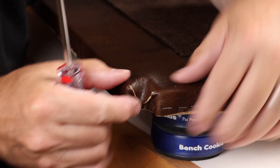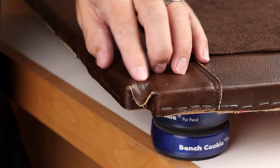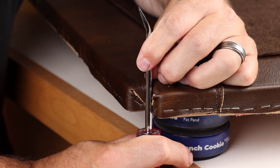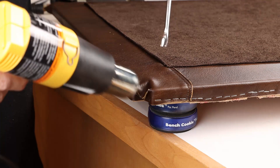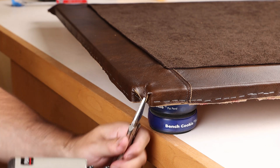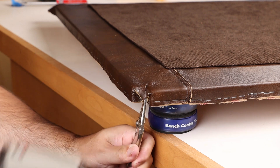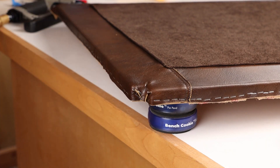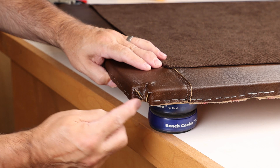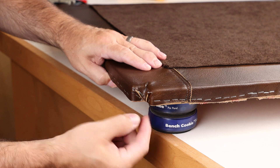Techniques you can do to increase the softness and pliability of the leather are to use a heat gun to soften it, or you can actually wet the leather. Press this down a little bit more and then get a couple of staples to hold that in place. Just get a hold of the dog ear with some small needle nose pliers and stretch that into position until you like it, and try to get a shot right about here. So now we've got good coverage on the inside corner, and if there's any overlap between the little tails we wrapped around and the dog ear, just run a razor knife right in there and pull out the little scrap.